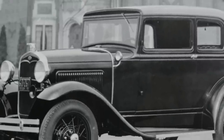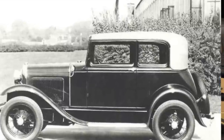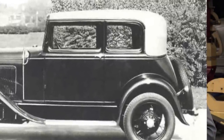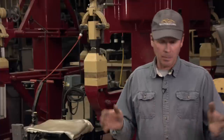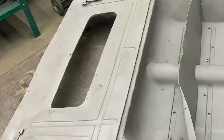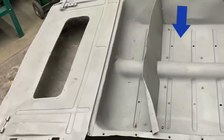Amongst many of the Victoria, with the no visor above the windshield, a slanted windshield, the bustle back in the back, canting the rear spare tire forward, they were really trying out a lot of new things. And it is a great idea. Our particular pan was just beat to hell, like the rest of the car. So the front, which is made out of about 18 gauge, it's a little bit heavier, it worked beautifully.